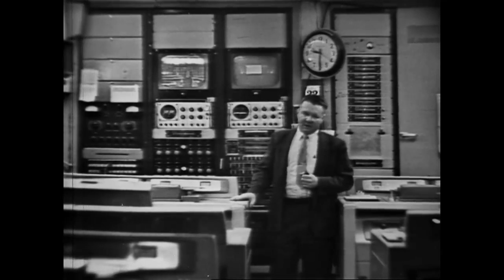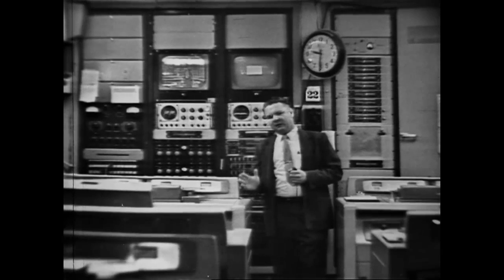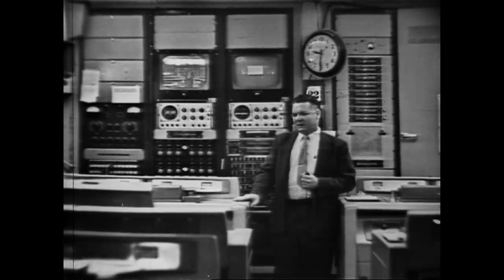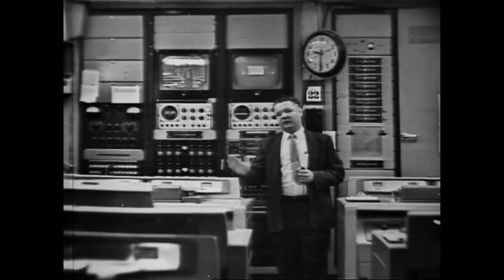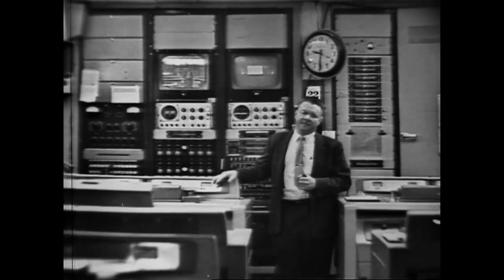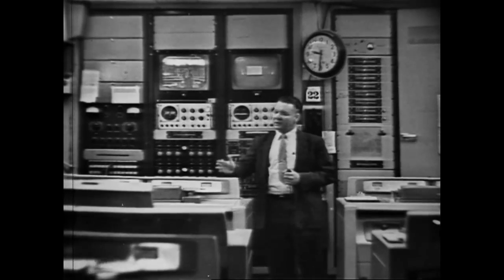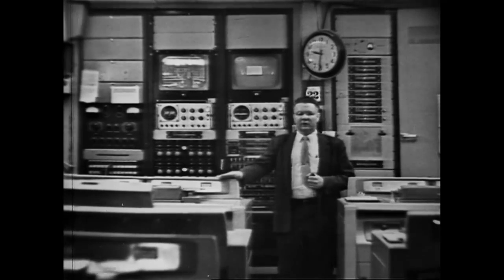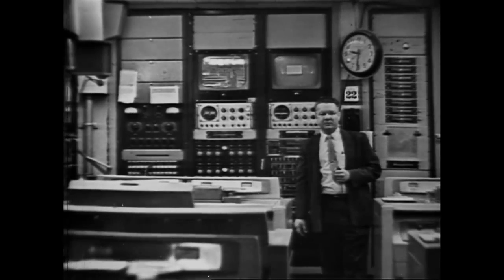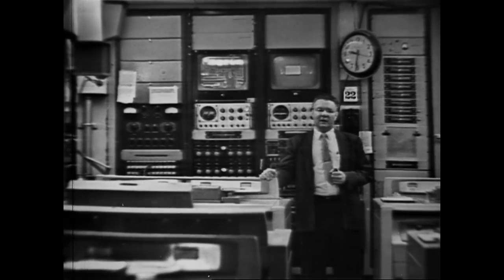Machines are started up simultaneously on playback. The machines do not start at exactly the same rate of speed, so there may be a difference of a quarter of a second in time between the two machines when the picture comes up to speed. Therefore, it's necessary for the operator to check the protection machine and either run it forward or back to synchronize perfectly with the machine that's on the air. That's necessary so that the operational director and the technical director in the studio may always have a duplicate picture to go to in case something should happen. It does happen occasionally — we try to keep machine troubles to a minimum, but it's not always possible. The tube replaced this morning may go out this afternoon.